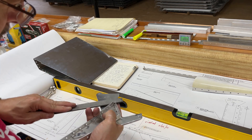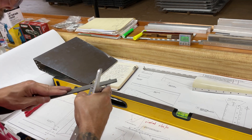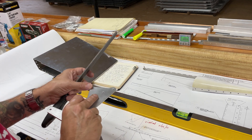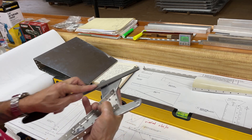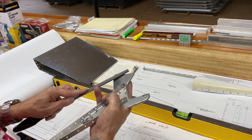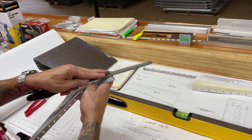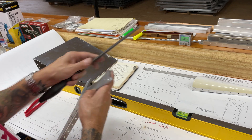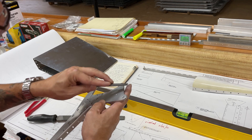It may be a little bit excessive to worry about the sheet metal corners — at least the exterior ones, the convex corners — but I just want to round those gently because those sharp points will eventually be under the skin somewhere and could create a stress point. Like I said it might be overkill, but I can't do much about the work that's already completed. From this point forward on the parts that I work on, I'm going to make sure they are deburred and every internal and external corner is gently radiused.